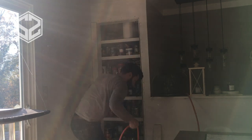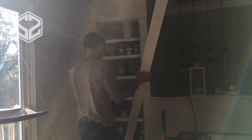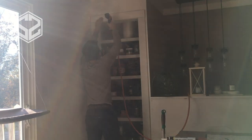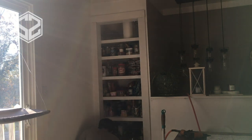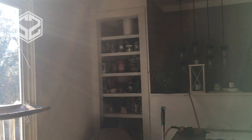Now everything on the inside of the pantry has been painted. My wife helped out with that and has even started stocking the shelves to see how everything would fit. I'm going to go ahead and put the moldings around the doorway to match the rest of the doorways in the house, and get that all finished off before attaching the door. I'm sorry about the lighting — I set up the camera and then the sun started setting and was shining on the camera. Right now I'm caulking around the edge of the moldings to fill in any gaps. This adds a good finishing touch and makes the quality of the work look a ton better.